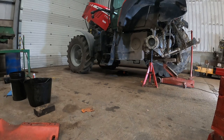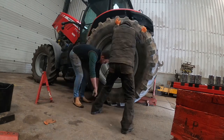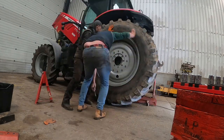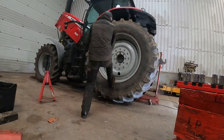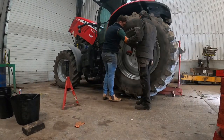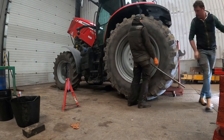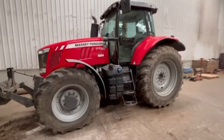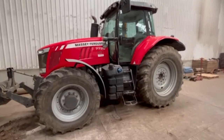All that's back together now, steps are back on, pulled the axle stand out, jacked it up, and we're just lining the wheel up. The wheel never seems to line back up again so you end up skipping around with a big bar - took quite a few jumps with that big bar to get it lined up. Got it on, put the first nut on, put the second nut on, run them up with the Milwaukee - it's about six years old now and I think it's losing its edge a bit, so I have to bar them all up afterwards just to make sure they're tight enough. Running it for a few minutes - job's good, it's right, no longer leaking. You could see straight away that it wasn't leaking. Really happy with that. Thanks for watching.